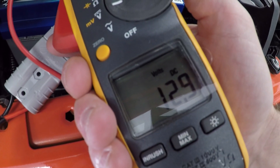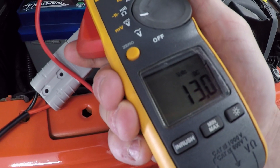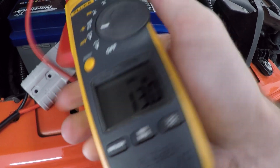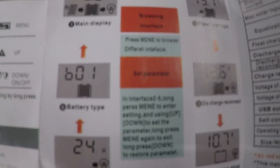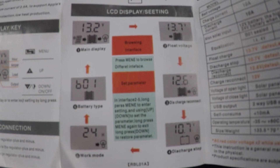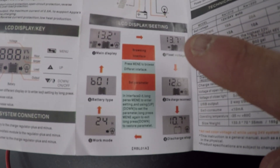The charge controller might be throttling it back just a little bit, but our DC volts are climbing quite rapidly. We went from 12.2 to 12.9, so it's gonna go all the way to probably 14.4 before it starts shutting off and floating. I think I have it set to 13.7 by default. I had to find the instructions real quick — there are some typos on the user manual, but it is set to a 13.7 float by default.